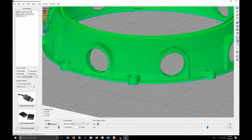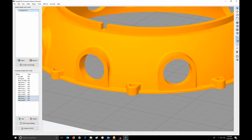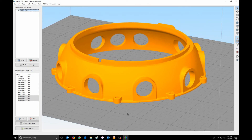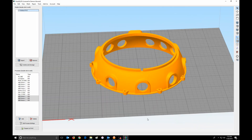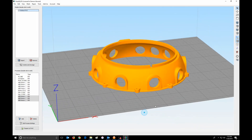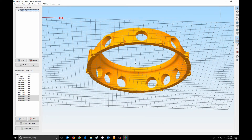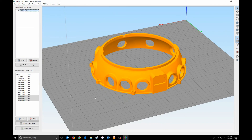I really like this. Another neat thing is you can change the infill, you can change your temperatures — you can change anything you want in layers by just changing your processes. The only thing you can't do unless you have multiple extruder heads is change the width of the extruder. So if you did have multiple print heads, you could, in theory, tell it to use one print head for a certain part of the build and then another print head for another part. I absolutely recommend it — you do have to purchase this, it's not a free program, but it's a kick-ass program. That was the tip I used 99% of the time I print.